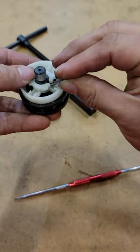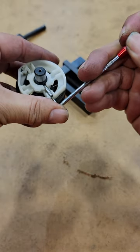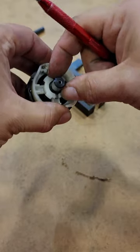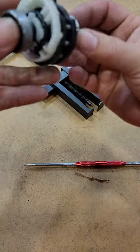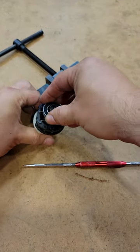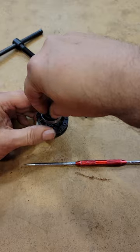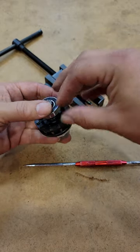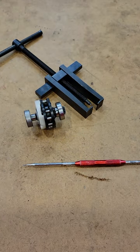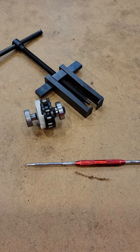Go ahead and put your locking pin back in — it just slides back in. Take your o-ring and put that back on. Then take your bearings and place them with a socket or something over this in a hand press, and press them down so the bearings are flush all the way down to where they seat. That's how to replace the felt. Remember: one gram of grease in the felt evenly throughout, and a gram and a half of grease evenly distributed on all the pins when you put them back in.